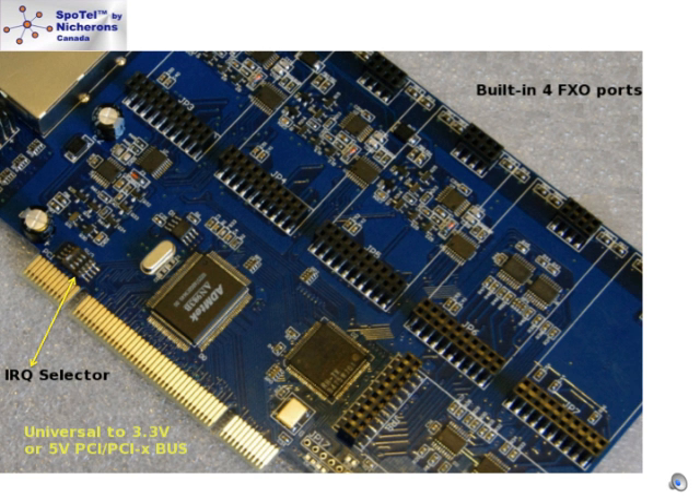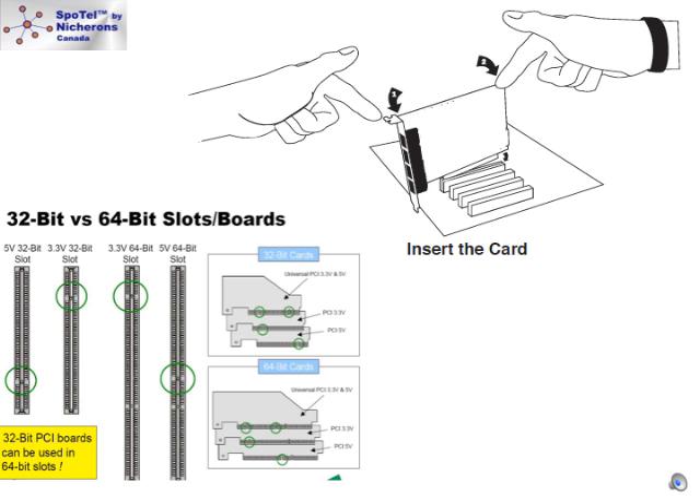The leading innovation allows users to adjust the interrupt frequency to reduce CPU load by up to 70%, and adjust the IRQ number to avoid interrupt sharing or conflict. The ST1600 series card can fit in any PCI slot in 32-bit 3.3 volt or 5 volt, as well as the 64-bit PCIX variants. The card will automatically detect and switch to adapt to the type of PCI slot accordingly.